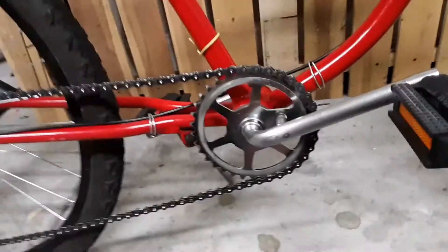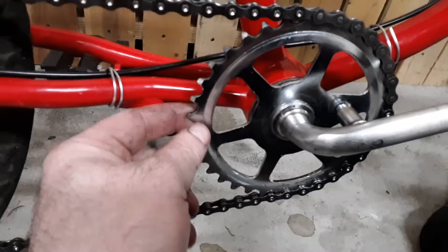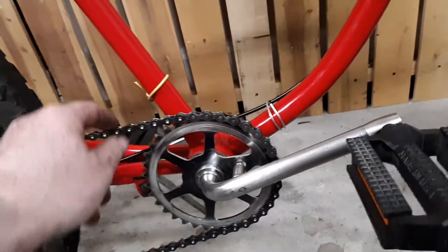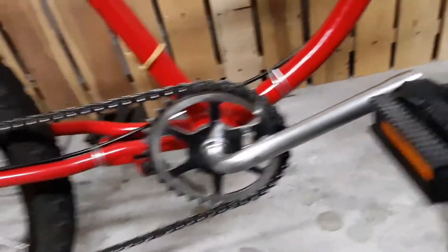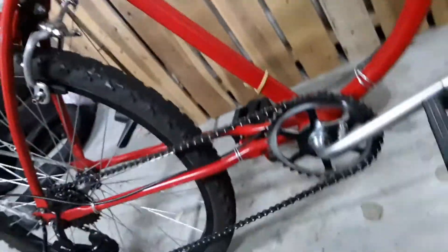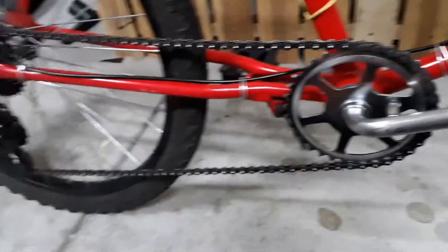This one here actually had a pretty thin profile on it. The old one was regular roller chain for a one-speed — the big thick kind — and it just won't fit this skinny derailleur chain. Anyway, all that's working now. This worked out really good. My spacer plate worked great with the back brake; this is a double braking system and it holds perfect — front and back. Everything looks good, it's getting there.